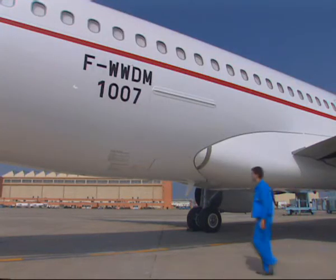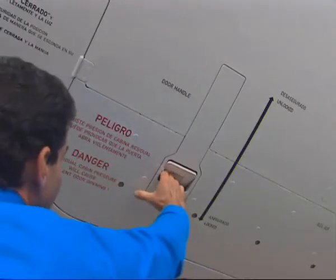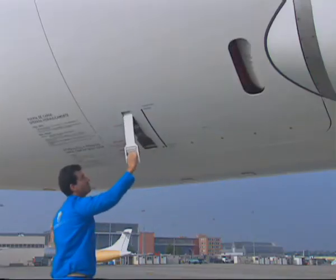To open the door under normal conditions, push the spring-loaded flap inwards to operate the door handle. The handle is released. When the handle rotates the locking shaft, it moves the cam of the latches, shows the red indicators retracting, and retracts the side pins and opens the vent door.